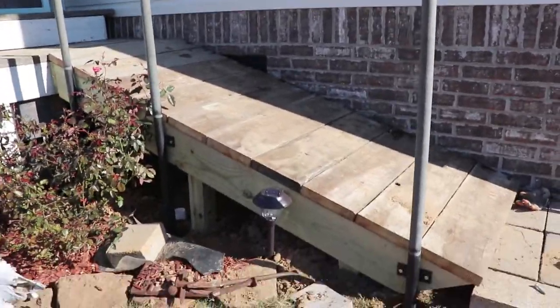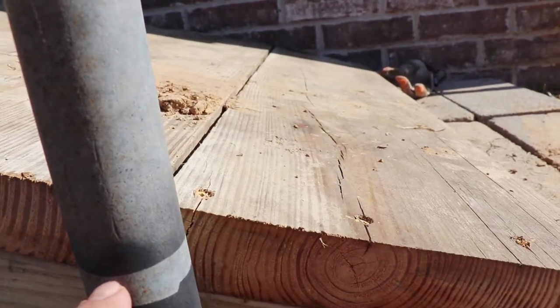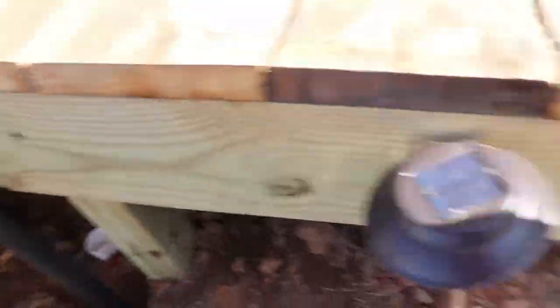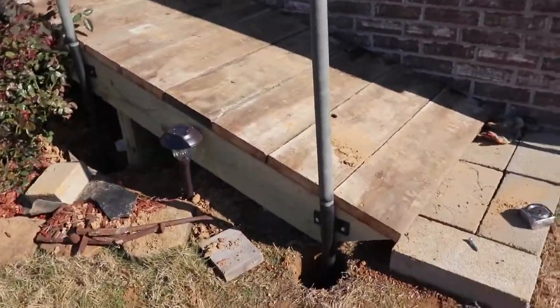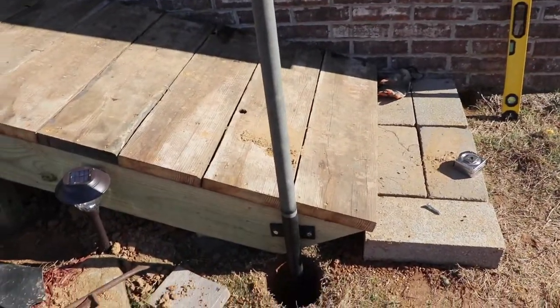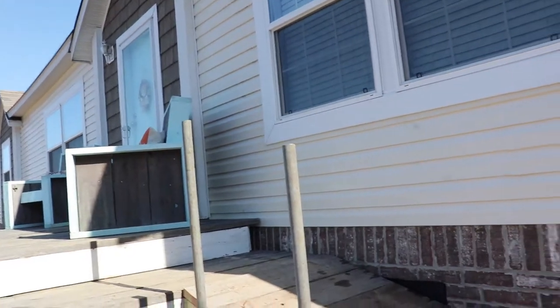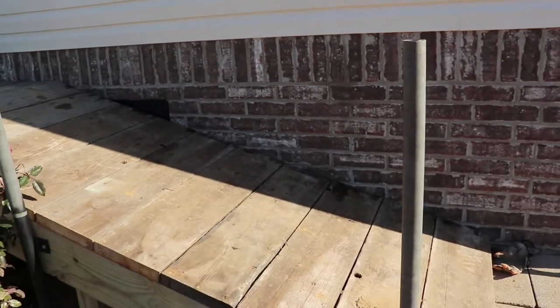I had a little help with this next stage. These marks show where the 34-inch point is, same as on all the other ones. Stephanie held these straight and on that mark while I lag-bolted these into the deck and leveled them up. Next is concrete - throw some concrete in those holes and let that set overnight. Tomorrow is Sunday and I'll come in and at least get the top rail on. That's when Xander's birthday party is, so get that top rail on so this ramp will be safer.